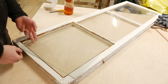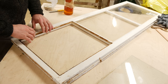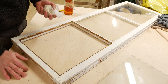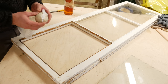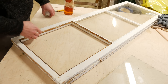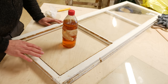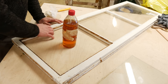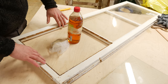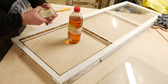You can see here the glass that I cut — I put that aside. Basically you have this wood here. I cleansed it all the way — all the old glass, all the old nails, and all this old putty, or glazing compound as some of you called it. Before you do anything, you want to take some oil and put it on here. This is linseed oil but I mixed it with turpentine because that helps it go into the wood quicker and get absorbed more.